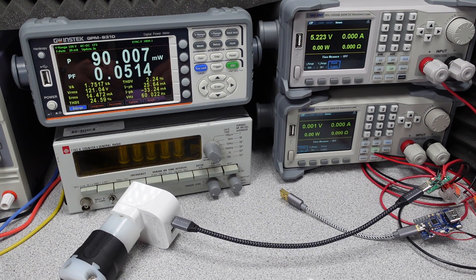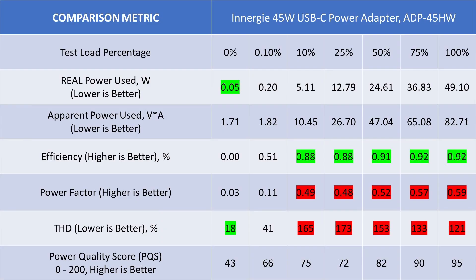The power does renegotiate on plug and unplug of either port. The power adapter turned off when overloaded at 56 watts, which is an okay overload limit. The idle power consumption is quiet and low — it shows they know how to do this right. The general performance is bad when taking into context the lack of power factor correction. The power factor is bad, like the dual 60-watt, but it is also a lower wattage adapter, so this is somewhat expected. The adapter meets the Department of Energy 6 requirements, and the USB voltages were all good.